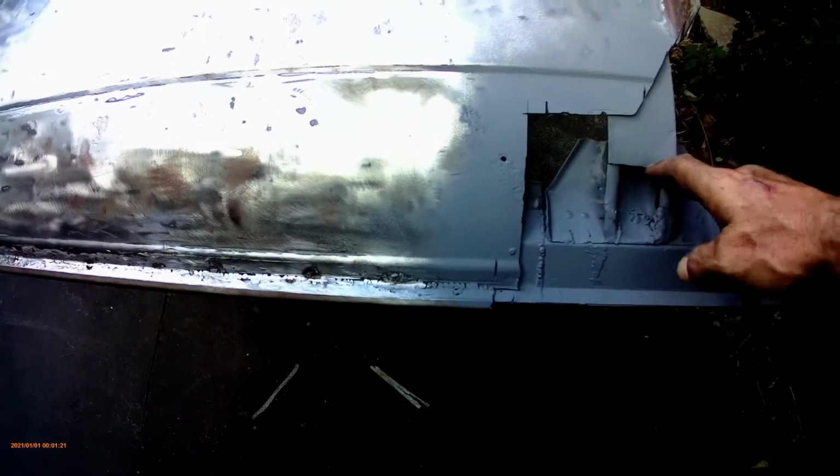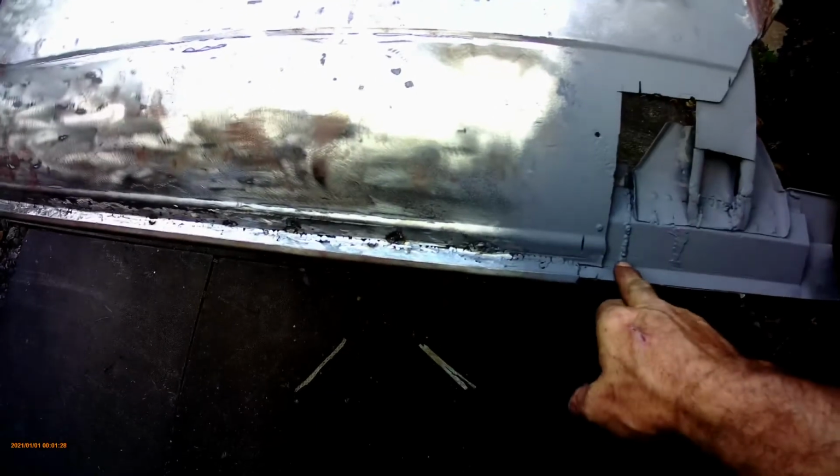The biggest nightmare I had was on this side. When they cut the roof, you can see there, they cut through the brace, so that wasn't there. I've had to graft that off Beryl, basically, the one that's coming off. So I've had to redo all this section. I've had to cut it back, put in the gutter and the roof supports, and then I'll show you underneath.